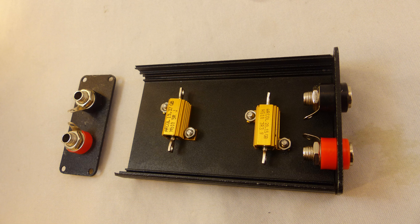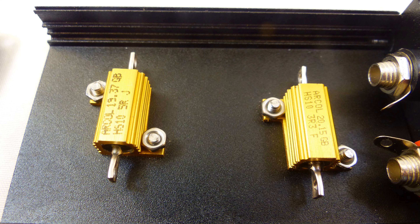The two resistors get bolted down with M2.5 metric screws with nuts. If you're careful when you drill the holes and don't drill through the mounting bracket built into the resistor, you might be able to thread an M2.5 screw directly into it. I used the drill and bore out the hole a bit, so I had to use nuts. M2.5 nuts and screws are common in some places. It might also make sense to put a couple of drops of heat sink putty under the resistor.